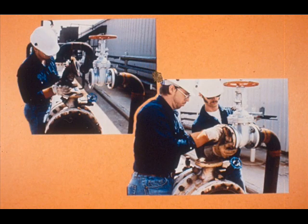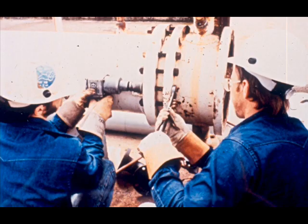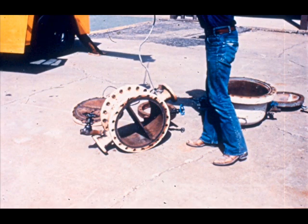Remember that all inlet and outlet piping must be removed or blinded before the channel head can be removed. You may now remove the channel head by unbolting all except two anchor bolts to hold it while you connect the lifting cable. After lifting the channel head with the cable and removing the anchor bolts, swing it to one side and carefully place it in a safe place.